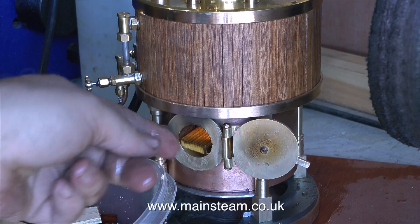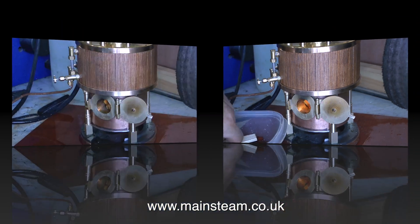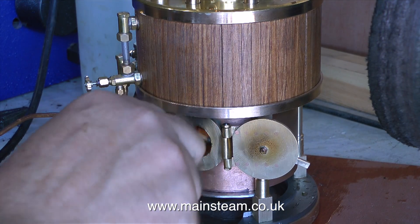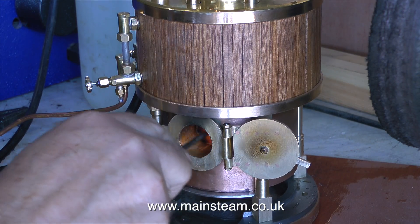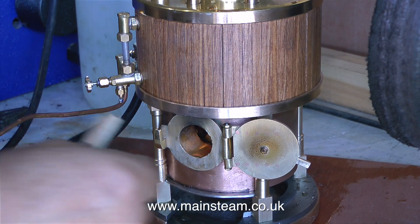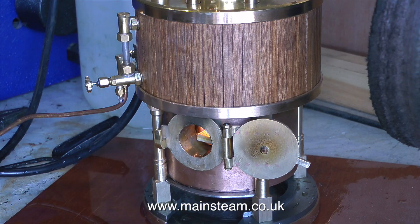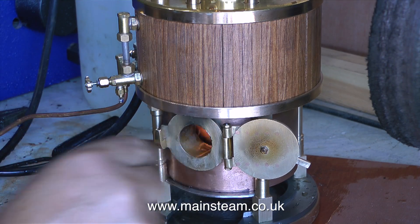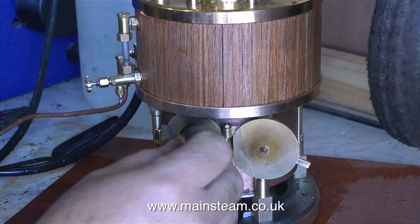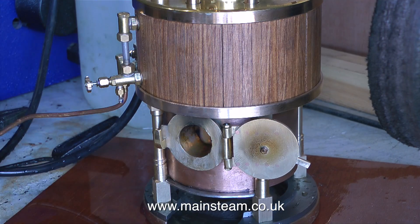Starting a fire in a model boiler is still a good experience. Most beginners — including myself when I was a beginner — cannot leave the fire alone. So here I am, poking about inside the fire with the firing iron, and now I can even pack some more wood in there. A few words about the blower: there's a distinct technique in using a blower. I don't mean the blower that sits on top of the chimney that you remove once you've raised steam.